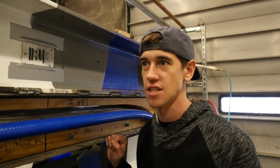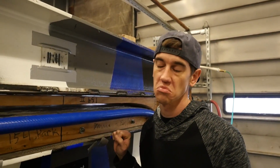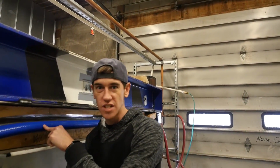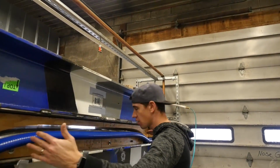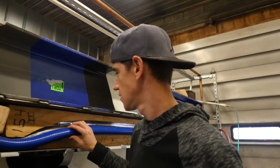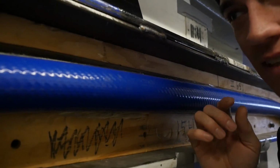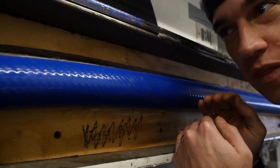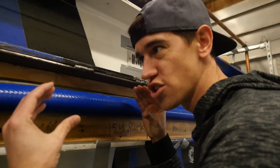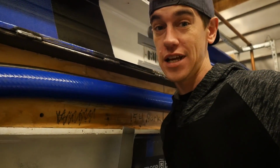How many pounds of pressure is this? It's gonna be up to 45 or 50 pounds? Oh, that's not that much. 50 pounds of pressure. Water fills up this container. It's like a tube. Presses it all together. Dude, amazing. It's cracking right now. It's not cracking. Think about all those layers we just put together with epoxy, fiberglass, and the wood core, and the steel edge. It's all just being smushed together right now. That's what makes it strong and flexible.